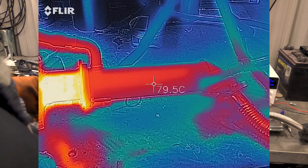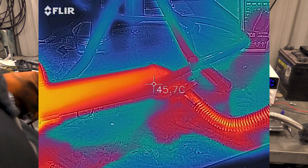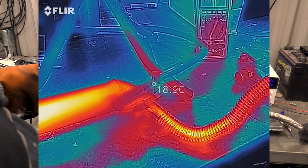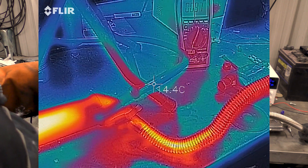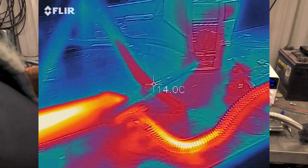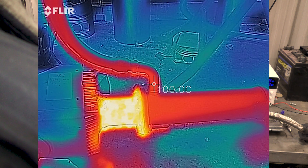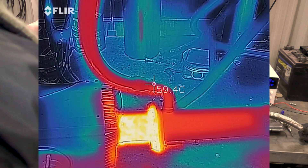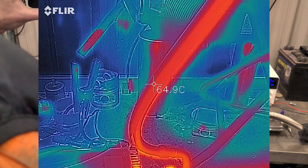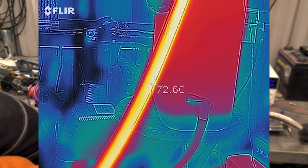Come down to the cool end. There's the inlet pipe temperature — around 30 degrees. So that's probably right: 30 degrees inlet. Swing along to the outlet which should be up near 100 somewhere — yes, 100 degrees. Hot pipe all the way up to the jug.